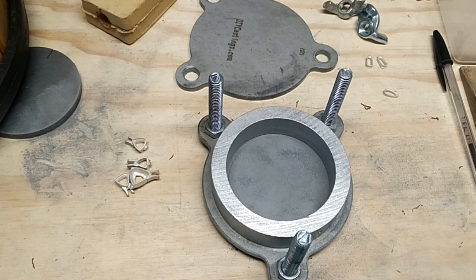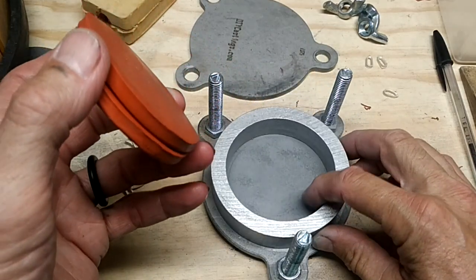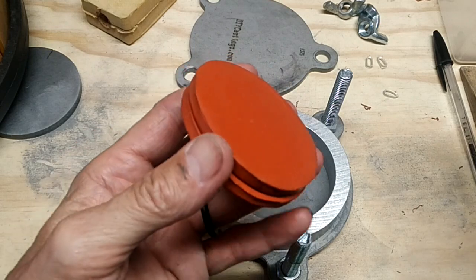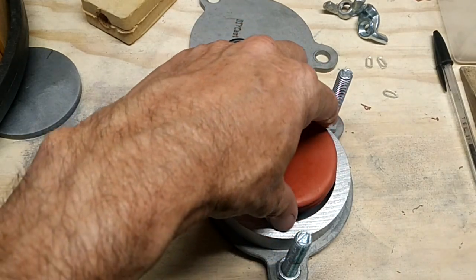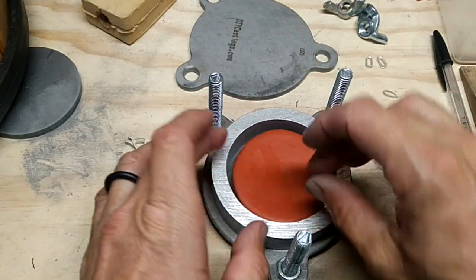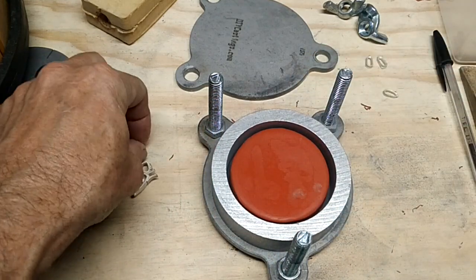On the mold holder, we're going to use four pieces — got a three-quarter inch mold frame. We want it to stand up above one piece of mold rubber, so we're going to talc one side, put that down just like that, and kind of place it in the middle.